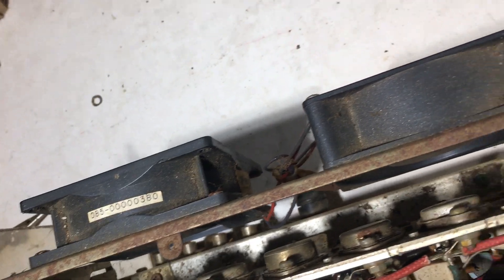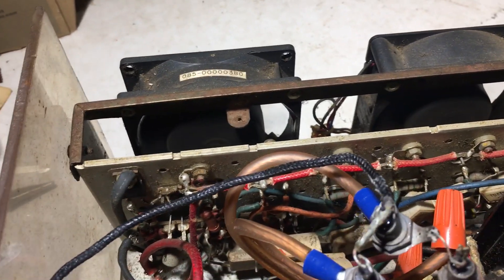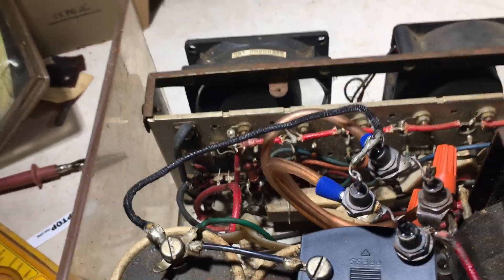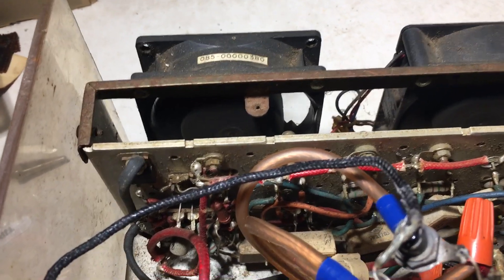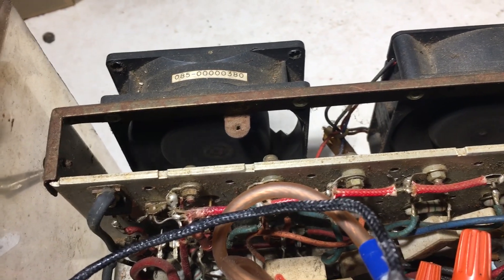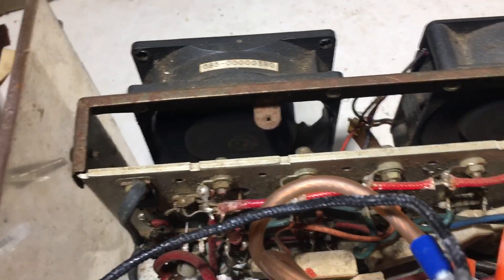You can see them on the back of the heat sink. I put two fans on this little power supply — they're computer fans. Now they're meant to run on 12 volts; if you run them on 14 volts they'll run really, really hot and really, really loud. So I ran two of them wired in series, so each one of them is running on just under 7 volts each. So they'll run much quieter, a little bit slower, but a lot quieter, and it won't make that roaring power supply noise you usually hear from your cooling fans.